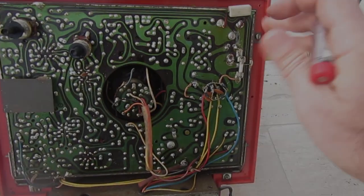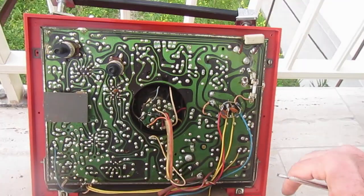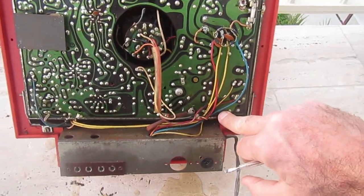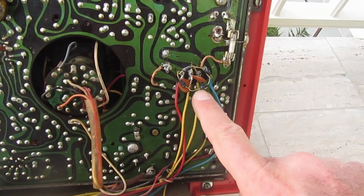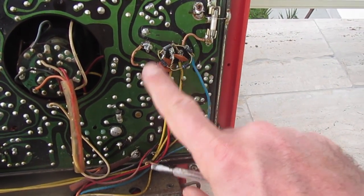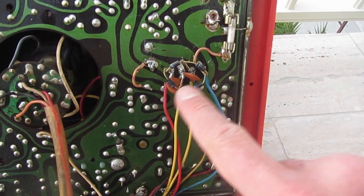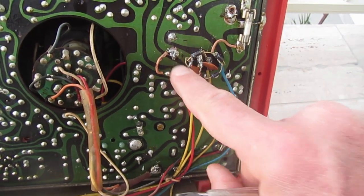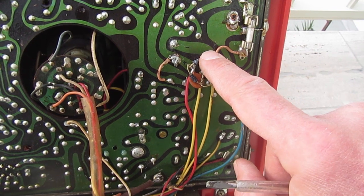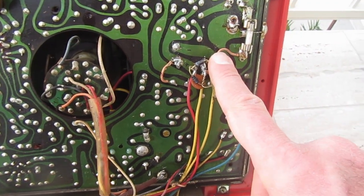Okay, on the inside, the back side, we find a very small PCB actually, and it appears to have some reworks in the ears. This is a bridge rectifier made with single diodes. I don't know if there was a bridge there, probably a selenium one maybe. So I'll find out when I open. Fuse.